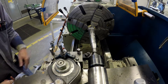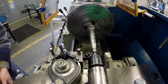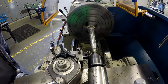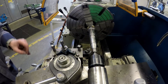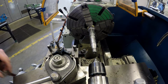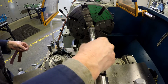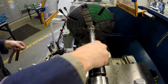Make sure you try your nut on before you get to 45 thou depth of cut. When I try the nut on, I try it on one side and then I reverse or flip it over and try it from the other side, just to make sure that there's no burr or something on the inside of the nut that prevents it from going on one side and not the other. I want to make sure that it can go on equally from both sides.